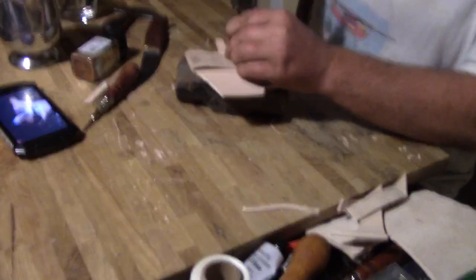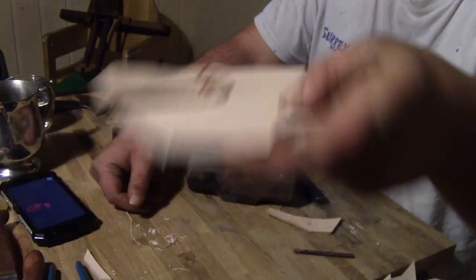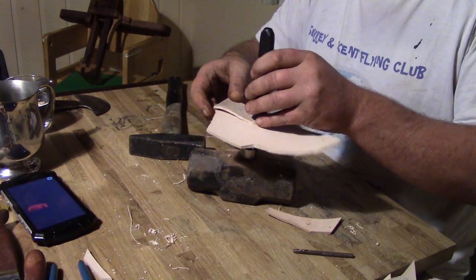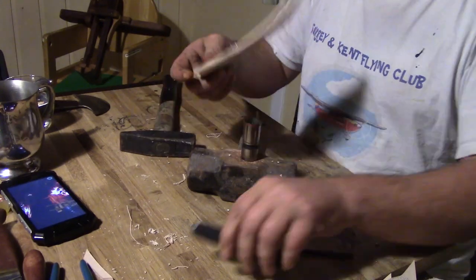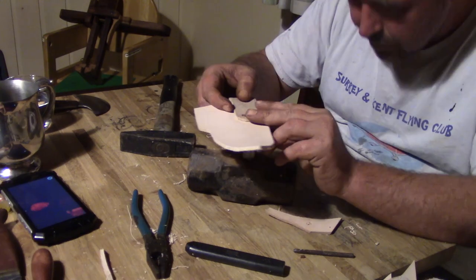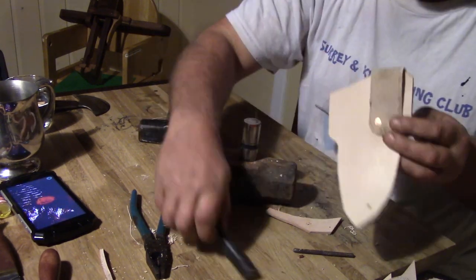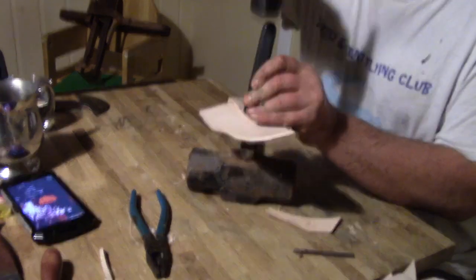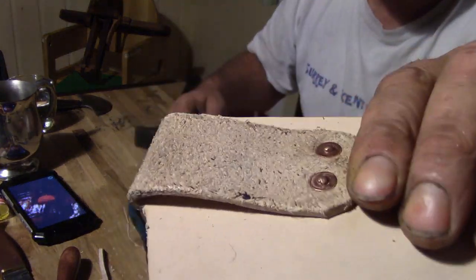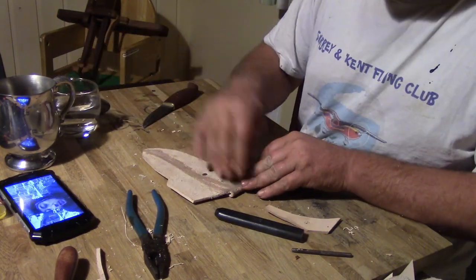We have got an old sledge head that I can bring into the kitchen and use as an anvil for punching holes. A couple of rivets in there — the washer is already on the rivets. We have got to drive the rivets home, make sure those washers are all the way down. Then take the edges off with a cross-peen hammer — or a ball-peen, whatever. Just got to make sure there are no sharp points on those rivets when you try and set them, because they go all goofy. For best results I found you file them and get the edges square and they come out beautifully domed. But this is good enough — you can hardly tell the difference.